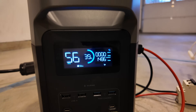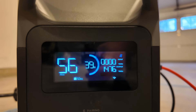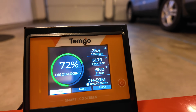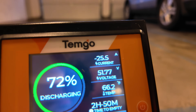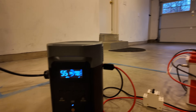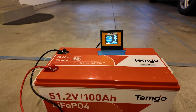Interesting to see what ends up happening here. We're at 39% on the Delta 2 — at least that's what it's guessing. The battery over here, the golf cart battery is at 72%. But notice we're drawing more amps now — 25 amps out of the battery. So as the voltage drops on the Delta 2, we start getting more of a voltage differential and more power starts coming out of the battery.